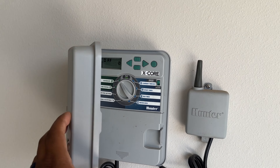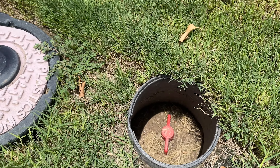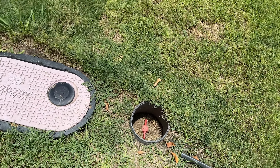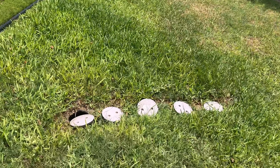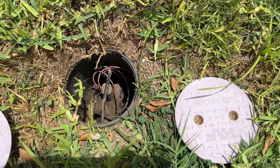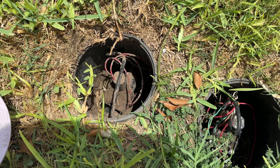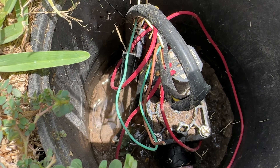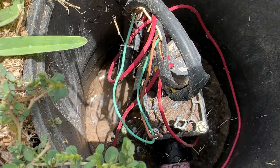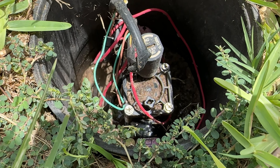You've got to know where your water shutoff for your sprinkler system is — here's mine. It's usually going to be near the perimeter of your property and it gives you a spot to physically turn your water off so the sprinklers can get no more water, and that will shut the sprinklers down. Now what we're going to be working with are these valves here. If you've got an in-ground sprinkler system like the one from Hunter, these containers should be dry. You might actually even be able to see my leak — you see that consistent drip of water. That drip is the valve being stuck, not closing properly, allowing water to drip out when with the water off you shouldn't get any drip out of that valve.